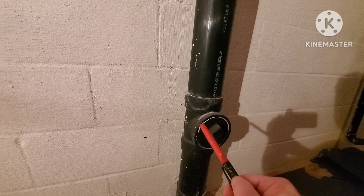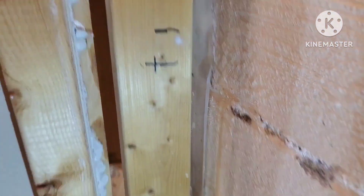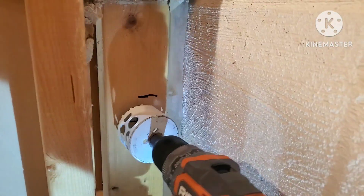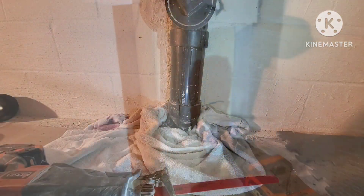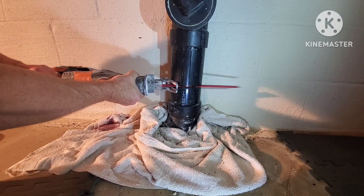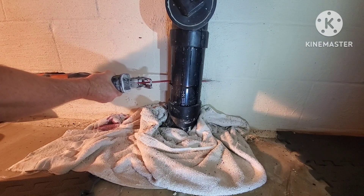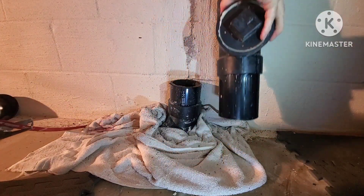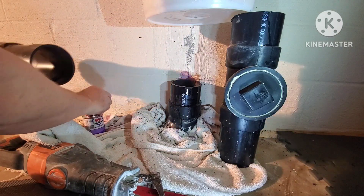Going to cut it on the top there and leave a little bit of pipe so I can move this thing up. On the left side, I'm going to drill an oversized hole for my inch-and-a-half drain line. None of these walls down here are weight bearing, so an oversized hole is not a big deal — it all gets covered with the cabinet. When you're cutting this main line, make sure you have a new sharp metal blade, nice and thick and stiff, so you can cut straight across as much as possible. You don't want a crooked cut on those.